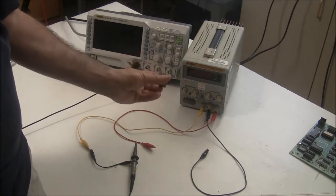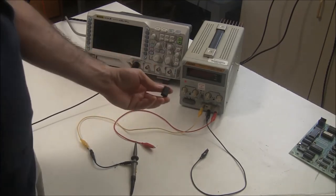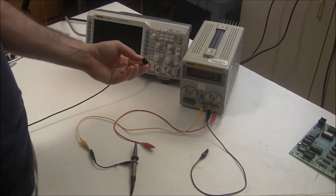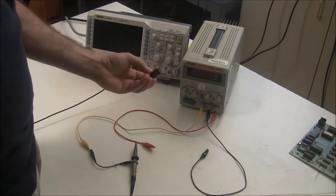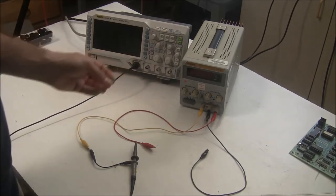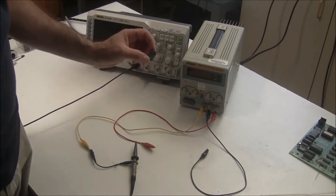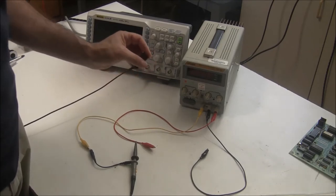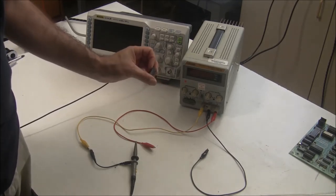One option would be to make my own oscillator — find a crystal or crystal oscillator and do some frequency division or similar trick to get it to 5 MHz. I could scavenge the part from my other Prophet 5, although I don't want to do that because my other Prophet 5 is not a parts machine. Or I can try to source a new oscillator, which I'm going to try first — I'll see if there's a drop-in replacement available before trying more drastic measures.